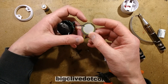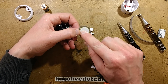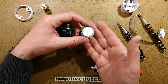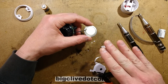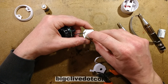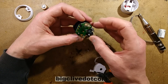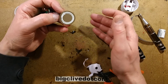Here's the piezoelectric transducer — it's a disc with a metal base, a layer of piezoelectric crystal, and metallisation on the other side. Piezoelectric crystal is a crystal that, when raised above its Curie temperature with a high voltage applied and then cooled, holds that charge. If you apply a voltage across it, the disc distorts, and that's why these are used to make sounders — it's a very simple way of making a very high output sounder.